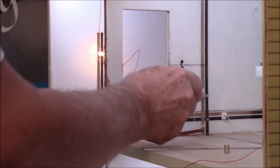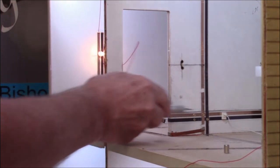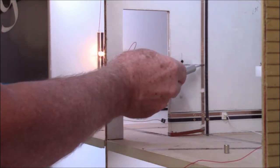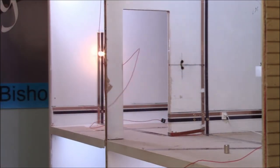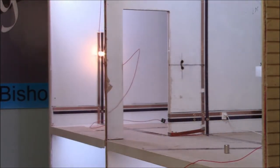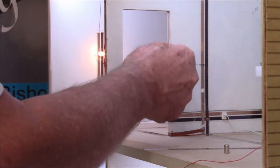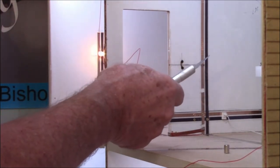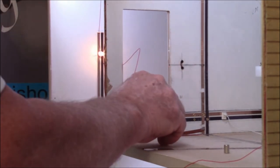And now that broke the electrical connection that we have with the grommet that's going into the red run on here, so that when we connect our switch to here, it will provide the red or the hot side up to our light, and our light should come on. It's going to utilize the black that's already connected on that edge. For the floor light, we want the other side of that switch to activate this run that's on here. And so what I want to do is to take the other wire, run it down, and we'll solder it